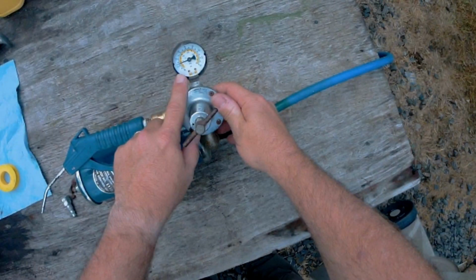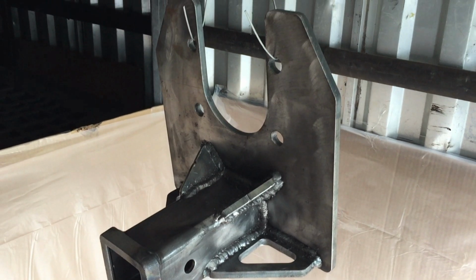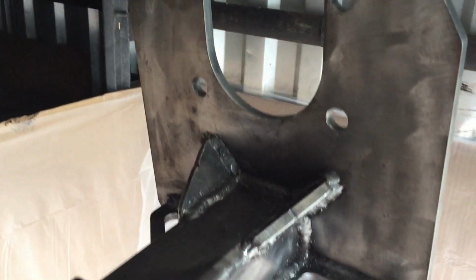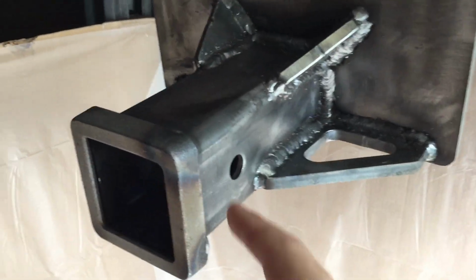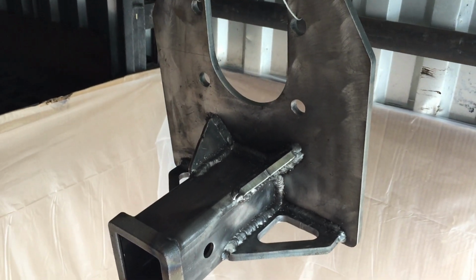You guys, keep watching. Well, you gotta set the pressure regulator for no more than 30 PSI, and you can do that pretty easy just by setting up a blowgun on your pressure regulator. I give it a pretty heavy spray of 91% alcohol, and that gets all that scum and stuff off of there. Now then, I shouldn't have to say it, but you need to wipe this down thoroughly. A little bit of goo that might be on the side of here. Get all that off of there before you go hanging this up ready to powder coat.